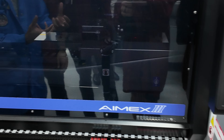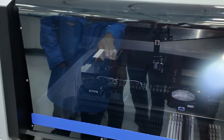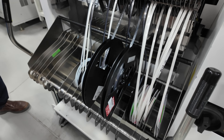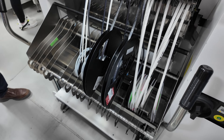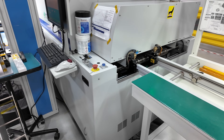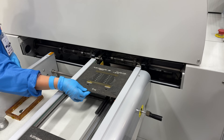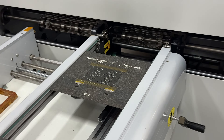After the paste is applied, the boards move on to the component placing machine. The machine can pick and place the tiny electrical components like the SoC accurately at a rate of nearly 10,000 boards per day. The components are picked off larger reels and placed directly onto each PCB. After the components are in place, the board moves into a large oven that looks like something you'd find at a pizza shop. The heat from this oven allows the solder to melt and flow and secure each component in place.